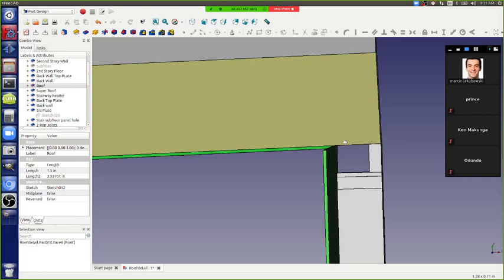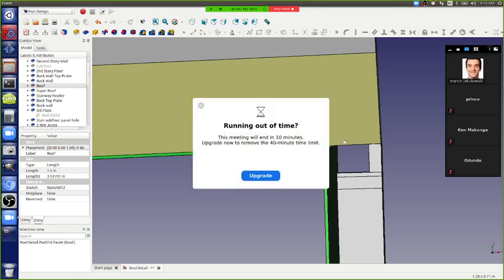You can get about 200 pounds because a screw is like an eighth inch, such and such fractions, about a hundredth of a square inch. So I look in my mind, I take 50,000 PSI, which typically compressive and shear strengths are the same. So I'm taking 50,000 divided by 100, which is how much meat we have in a screw. It's about an eighth inch square. So I divide 50,000 by 100, it's actually 64, but close to 100, I get 500 pounds. So that figure of 200, yeah, that's like a safety factor of 2 over just a plain 50,000 PSI strength of steel. And the screws are probably more than 50,000 PSI because they're hard steel. So that's the idea there.